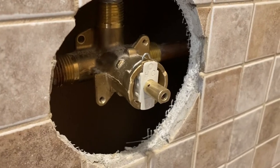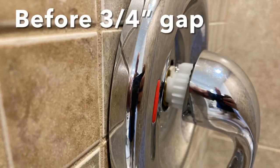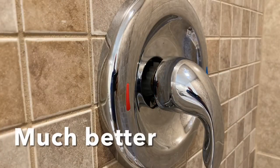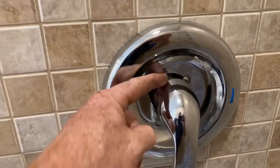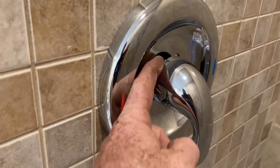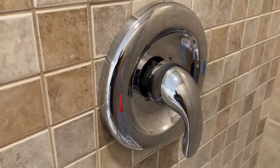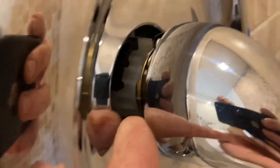Here's the moment of truth — hopefully you remember what it looked like before with the large gap. There it is all finished. Whittling down that plastic piece actually took longer than drilling and tapping the brass. It does look better — you could probably go a little more, maybe another eighth of an inch — but there is still some of the mechanism visible in there. Part of that is reflection off the back side of the handle, which makes it look worse than it is.